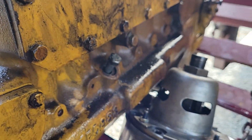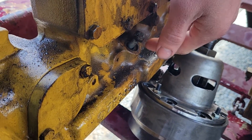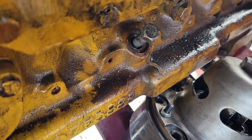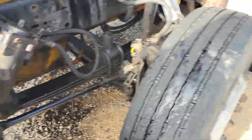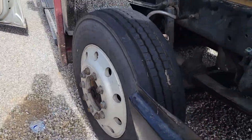So we got it pinned. Should have made a video on how to take it off because it's not super easy. You got to pin it — there's a hole, this bolt's just sitting in here, but there's a cam that spins down the bottom of this. If you look down in the hole — can't really see it — but there's a cam in there and it's completely round except for where this bolt fits. There's a notch, and I think that means number one's at top dead center. There's a hole in the flywheel you have to line up too.